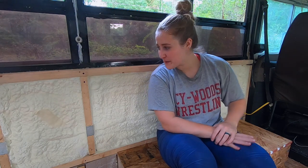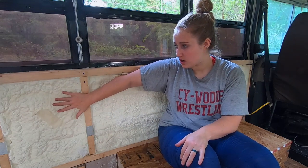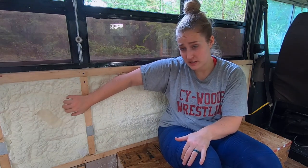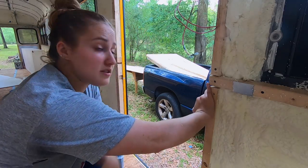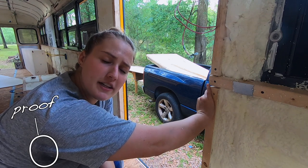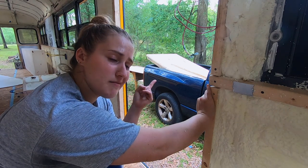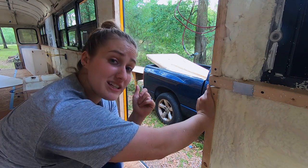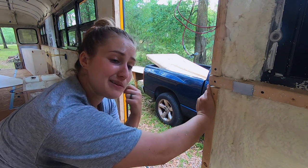Paco said, we are going to be putting up our walls today. So it's going to be the wood that goes on the sides to cover up this insulation that we just did. As you can see, sitting out there on this beautiful spring day when it is probably 95 degrees outside here in Houston, we decided to go with 4x8, 15/32nds, which is about half an inch, sanded pine plywood.